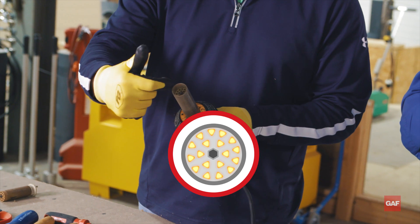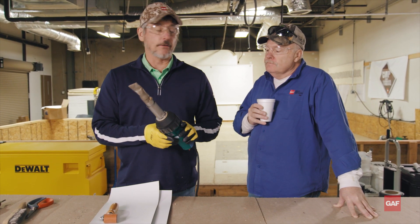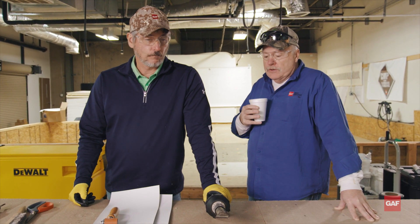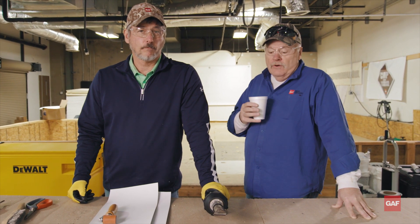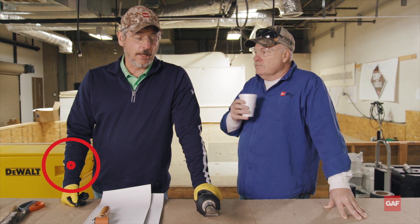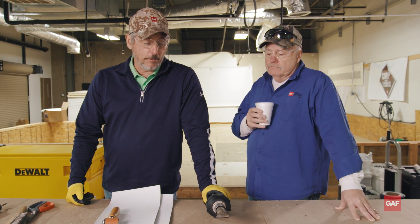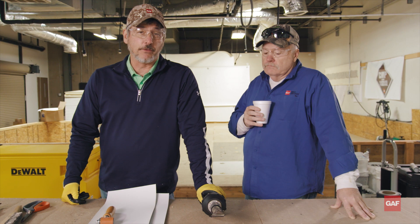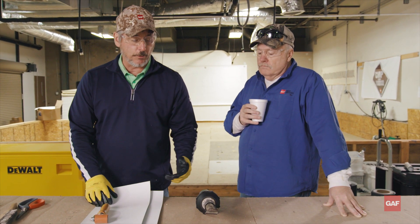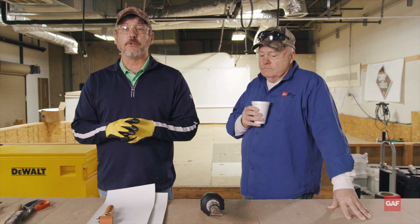If some of them are not glowing, or only half the element is glowing, that means it's time to replace it. This has a setting from zero to ten. What are your thoughts on guys hand welding on ten, Dave? With TPO, I think it's way too fast or way too hot — they have to increase their speed and it gets outside their comfort level. I would always kick mine down to seven, even if I'm doing a butt end. To compound that point, if your gun's set on ten, you've got to move pretty quick, and anytime you do anything quick, you're bound to make mistakes. I weld at about seven as well. If we're welding unsupported or non-reinforced membrane, that changes things, but right now we're welding field membrane with reinforcement. Typically, seven will get you a good weld for field welding — though ambient temperature plays a big role.